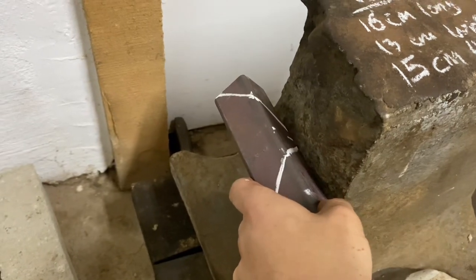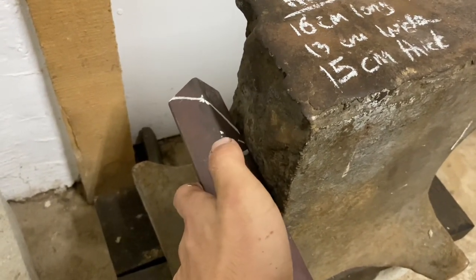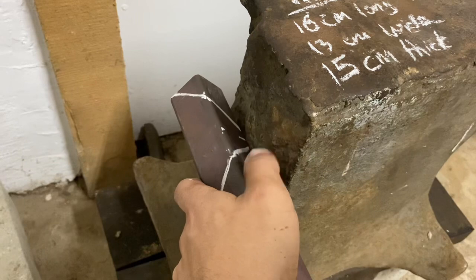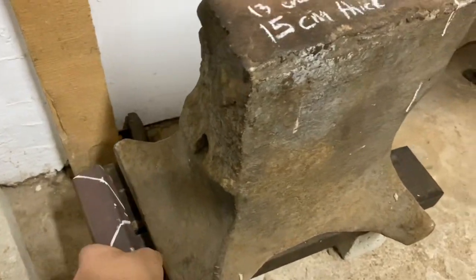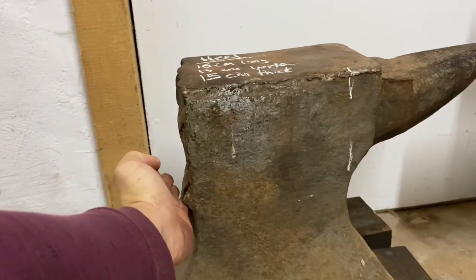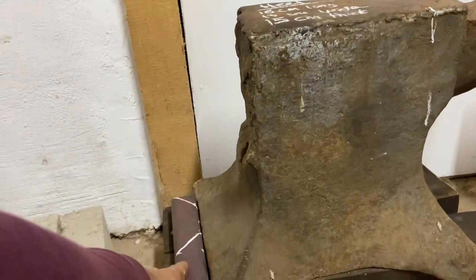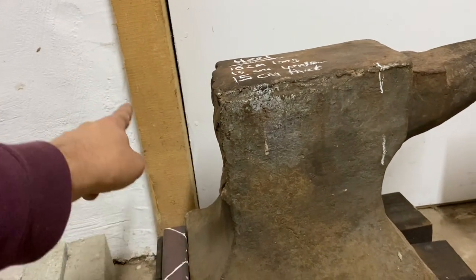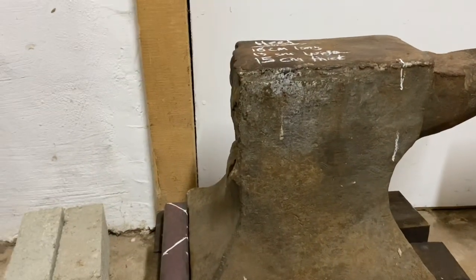They'll never ever separate. And then obviously do exactly the same once I've got a heel that I've made for this: preheat this, preheat that, and then build all this up with weld. So I think I'm gonna do that. I think that's gonna be the best bet, just to get this bottom piece, because it's not much. If you think about it, it's gonna be that bit there. It's not much that I have to have at the bottom, but I'd rather use a piece of steel than just weld on a piece of 90 mil plate and build up this huge section here. I'd rather have that, and then I'll just build up where need be. So yeah, that's what I'm thinking.